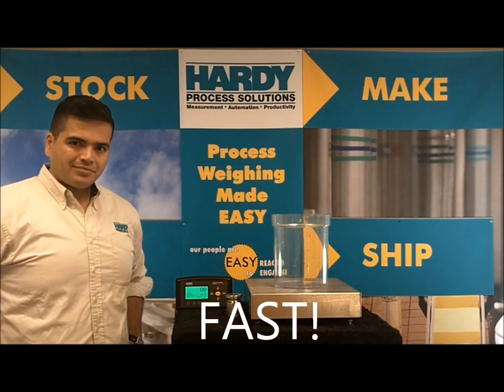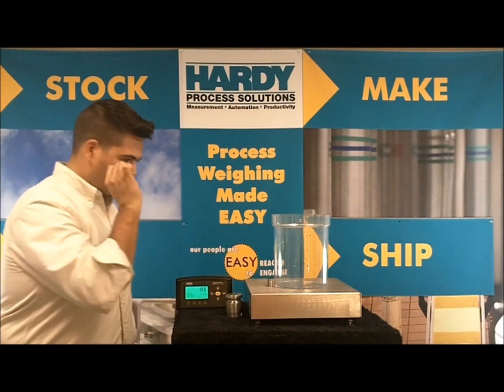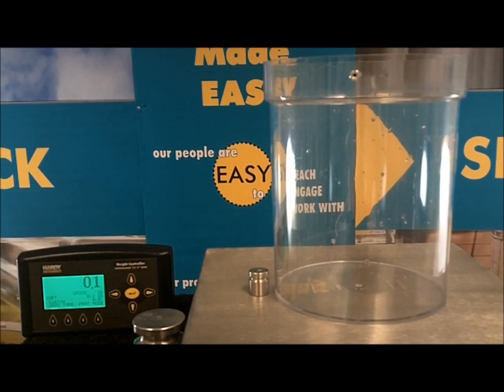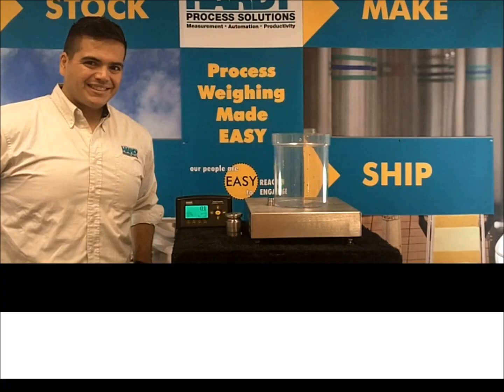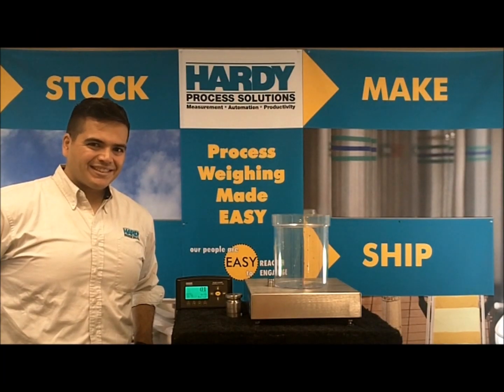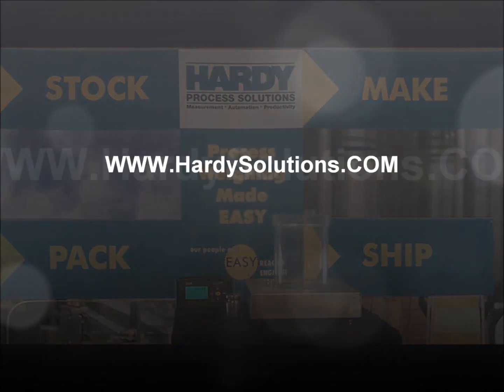It's really that fast. All you need is a small verification weight — five to ten percent of the scale capacity. Put it on, verify the weight, now take it off, and make sure you return to zero. This last step exposes structural defects that traditional calibrations only mask.